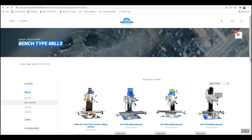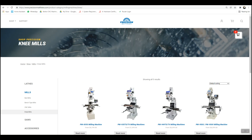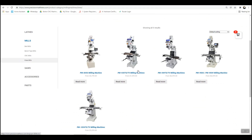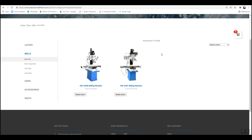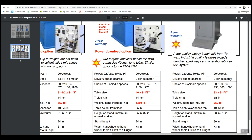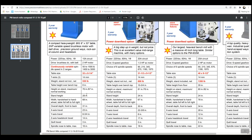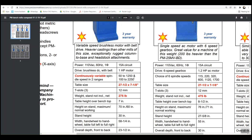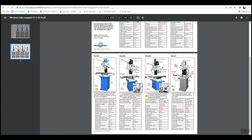When choosing a mill, other than making sure you can source a ball screw kit, the machine's price and power requirements will probably narrow you down to just a few options. Then there are two other things to consider. The first is rigidity — the more rigid the machine, the more material you'll remove in a single pass. Just look at the weight: a 1,000-pound mill is going to be more rigid than a 500-pound mill. The second is spindle power and max RPM. Generally speaking, a 3,000 RPM spindle is going to machine about 35% faster than a 2,200 RPM spindle if it's got enough power.